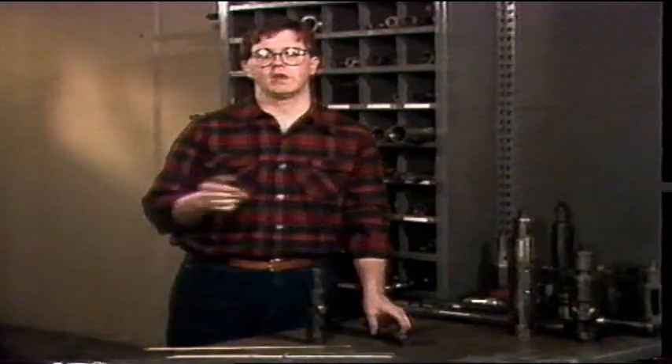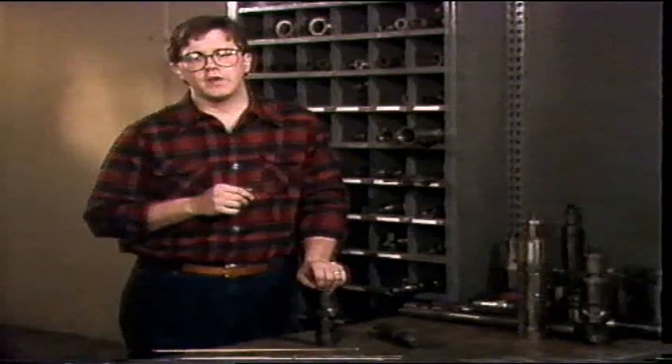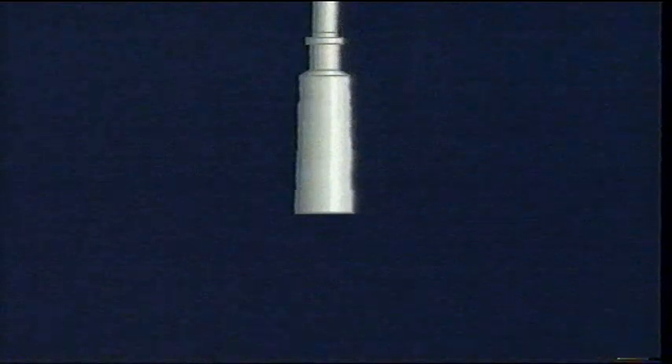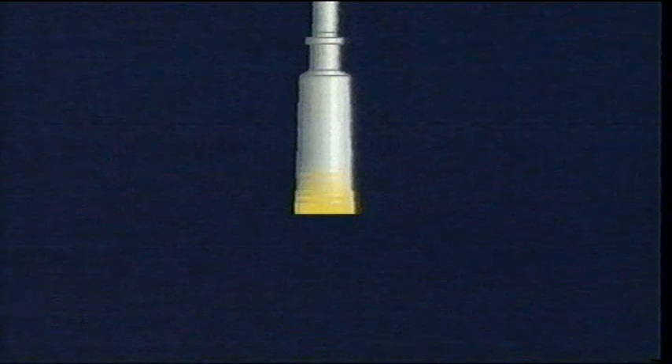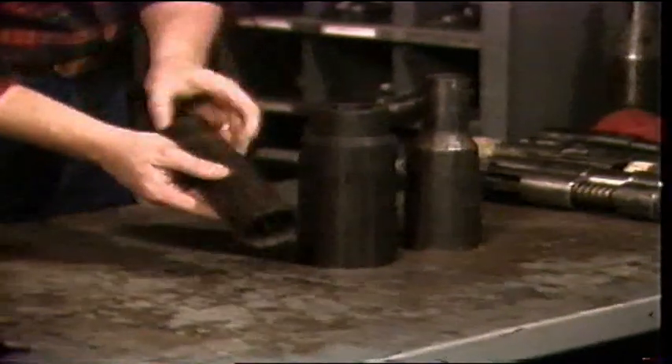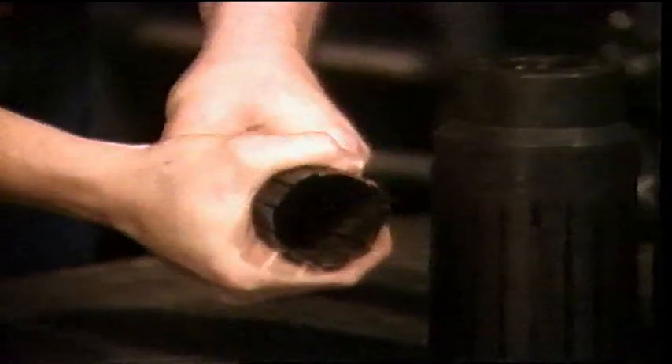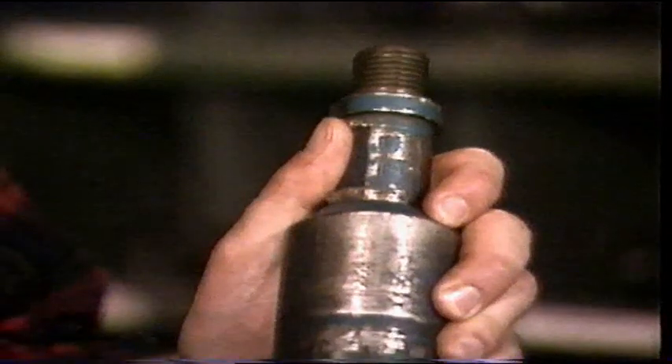Sometimes, in spite of our best efforts, the wireline breaks or tools become stuck in the wellbore. Often, both wireline and tools are lost in the well and must be fished out. The wire finder is used by the specialist to locate and coil the upper end of the wireline so that it may be retrieved with a wire grab. One type of wire finder is a soft metal cylinder which can be flared out to conform to the ID of the tubing. When lowered on a conventional wireline tool string, the wire finder will contact the top end of the wireline and the specialist can coil or ball up the broken end of the wire, allowing it to be engaged much more easily with a wire grab. Another type uses a metal skirt slotted to allow it to flex out against the tubing wall and pass through reduced ID restrictions.